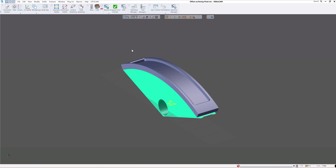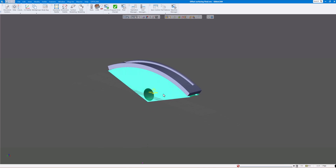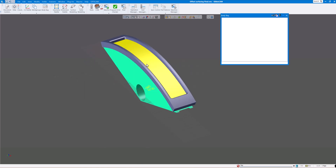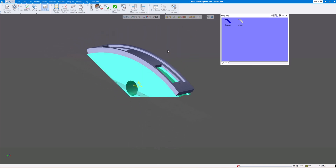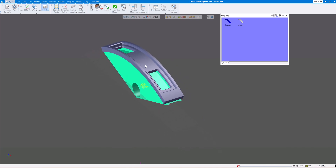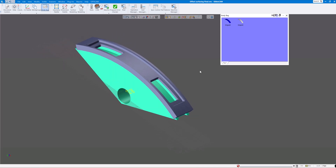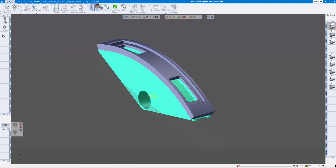The solution is I'm still going to do this on my fourth axis vertical, but now I have a fixture that's a little more reasonable. Here's the center of rotation of the fourth axis, and here's the actual finish part — what it needs to look like. I don't want to use a ball end mill because these are sharp corners down here; they take forever with a ball end mill and I still have to deal with the 90-degree edges. So the solution is we're going to use the fifth axis module in four axis mode.